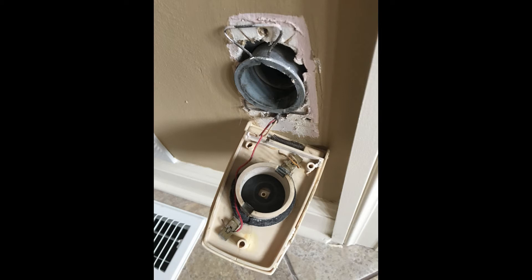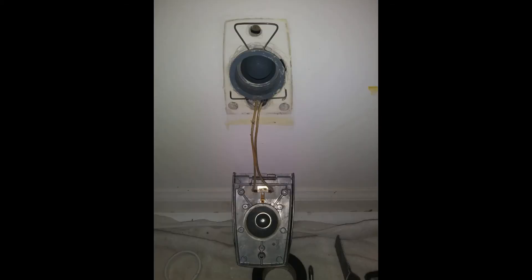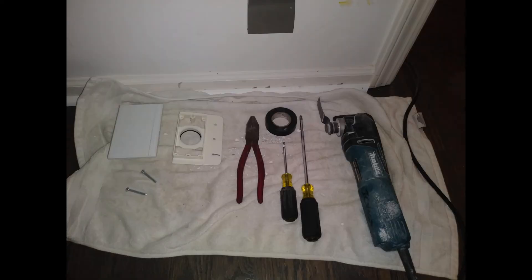Here's the plastic inlet taken off the wall. You'll notice there's no mounting plate — just a wire clip that holds the elbow flush with the face of the drywall, and three holes for toggle bolts. Same thing on the metal inlet. So this is the one we're going to work through changing out today. I did a whole house full of these and took pictures of one to share. We're going to disconnect the wires of the old inlet and take that off. Here are the tools we need — nothing too exotic. The most important being an oscillating tool, the new vacuum valve wall inlet, and a universal plastic mounting plate.